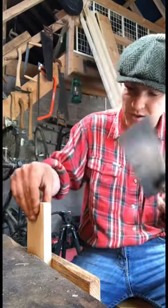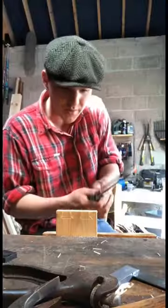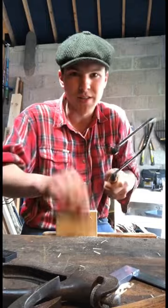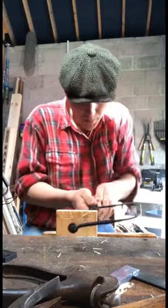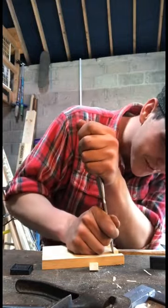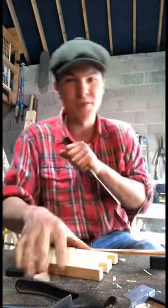Damn, she cuts very quick, no problems at all. Grand job. Then we can grab our coping saw and just cut out the chunks here. So now we have it like this, we just use our chisel here just to finish it up, make all the edges perfect.